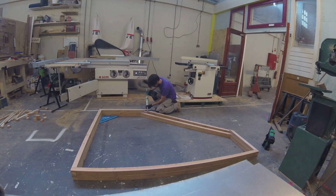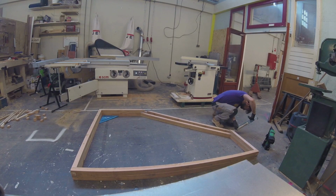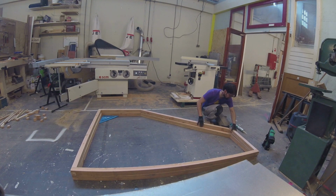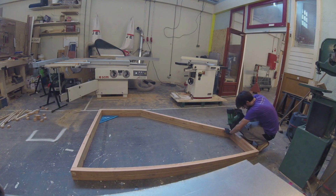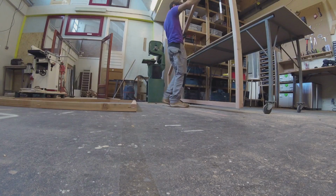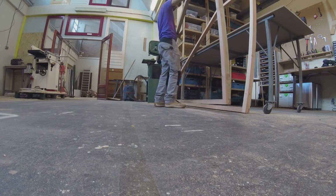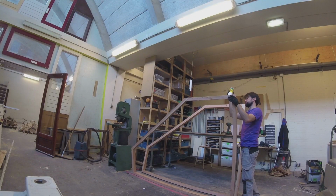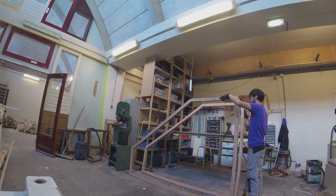Stacking the assembly makes life a lot easier if the first one is done alright. In between the frames, spacers get placed to keep them apart and stable. The spacers are made of the same resawed frame pieces. Again, they are attached with glue and screws.